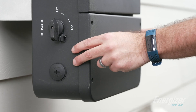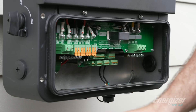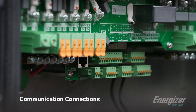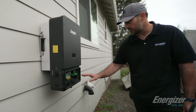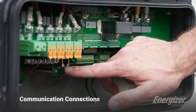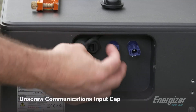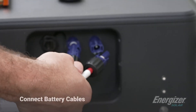Once the inverter is secure, remove the cover — this is the wiring section of the inverter. What we're going to do now is wire from the BMS up into the inverter. Here are your battery connections. If you have a new solar install, here are your MPPTs where you string in your inverters, and then you have your comms section down here. This is your grid input if you're not using a gateway. In this install and most installs you'll be using the grid input in the gateway, and we also have a grounding bar here for your connections. Also from the BMS, what we'll be wiring up right now is the comms cable that's included. Now that we're wiring up the batteries to the inverter, you remove the caps from these connectors — these are the DC battery connectors — and then you can unscrew the comms input as well. Both cables are shipped with the batteries.